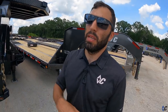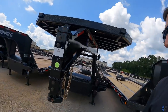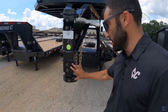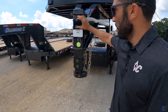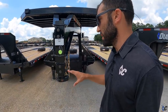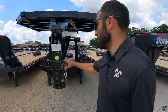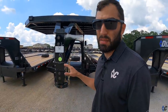So in late 2019, early 2020, we started designing what we're calling the Telus coupler. The cool thing about the Telus coupler — we got rid of those big plates and we're still using the Bulldog coupler head at the bottom, which still has your three inches of adjustability built in. But what we've done is redesign the rest of the coupler to now have three more positions — so you've got a total of about nine inches of travel built in now, instead of just the three that Bulldog had. We shed a lot of weight from our original design, but it's light and very strong, with big ribs coming around the front that circle all the way around to the back — a heavy-duty reinforcement rib. It's heavy duty.